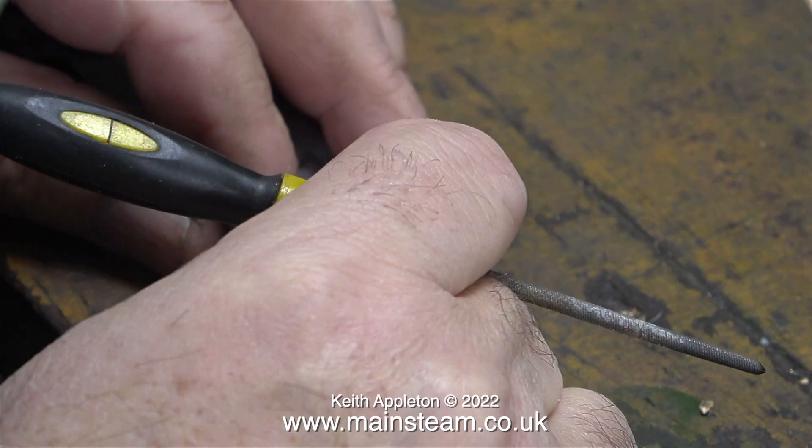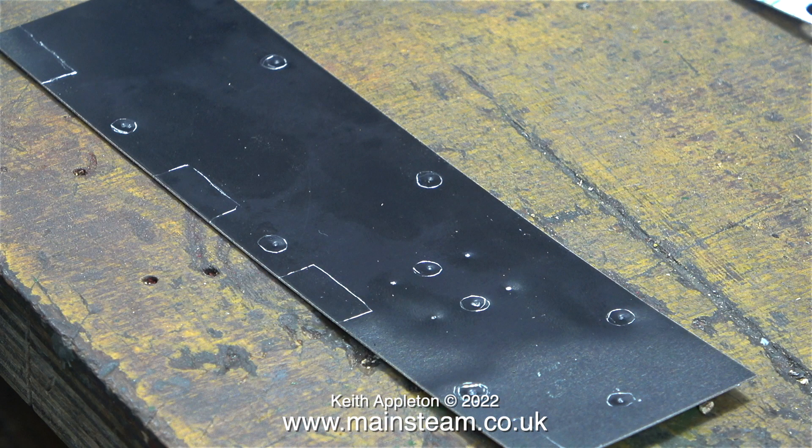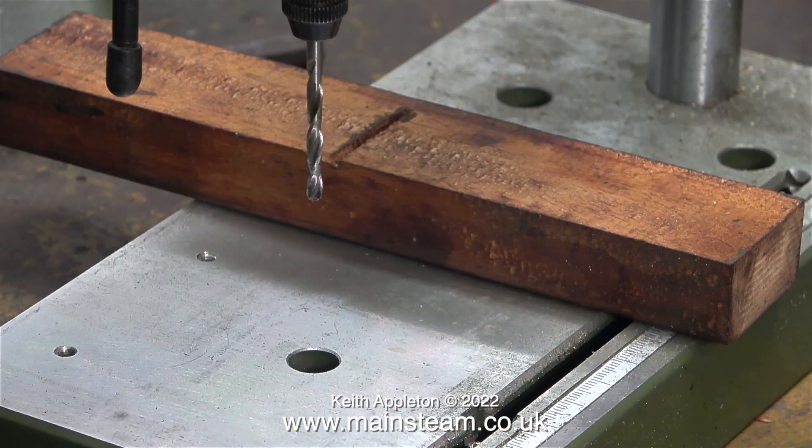For transferring the hole positions from the Christmas card template to the anodized aluminum, I'm using an old needle file that I broke and ground the end to a point. I find this much better for scribing lines on anodized parts because the anodizing is very hard. Here is something I definitely do not recommend — I only did it for the video — I used a center punch, but as you can see the center punch is distorting the aluminum and it's not looking too good, but keep watching and you'll see how it works out in the end.